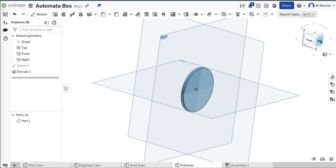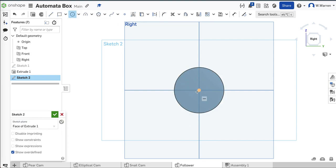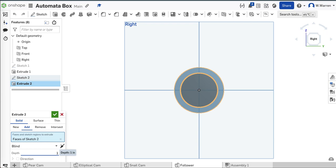I'm going to put a circle right on top of that — a little bit smaller and a little bit thicker. Sketch on that face. Circle tool. I'm going to do 1.5 inches — that'll give me a quarter inch on each side. And I'm going to extrude this one — I did the other one one eighth, I'm going to do this one twice as far, one quarter of an inch. Actually let's do three eighths — it's triple stuffed, like a triple stuffed Oreo. Three eighths of an inch. Now that part's thicker. That's where the cam is going to ride.